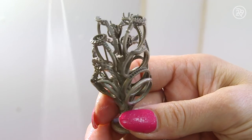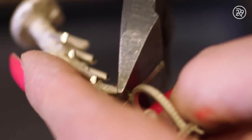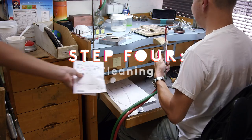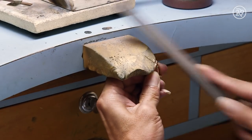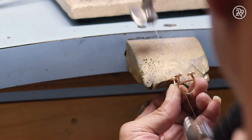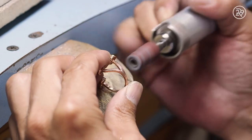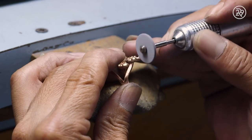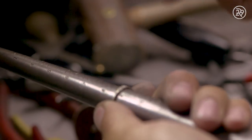The casing is removed and each ring is cut from the tree. The ring is then sent to be cleaned and prepared. Files are used to remove the sprue which connected the ring to the tree. The support bar is detached and the ring is sanded to get rid of any rough edges or unwanted metal fragments. Finally, the ring is hammered to the correct size and shape.